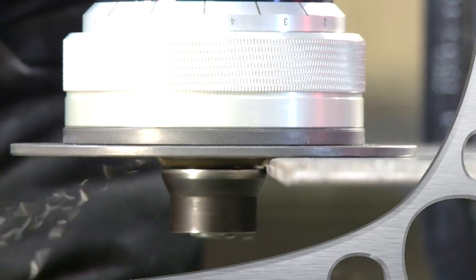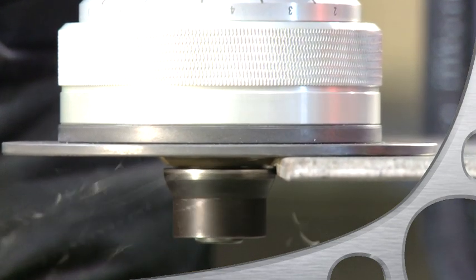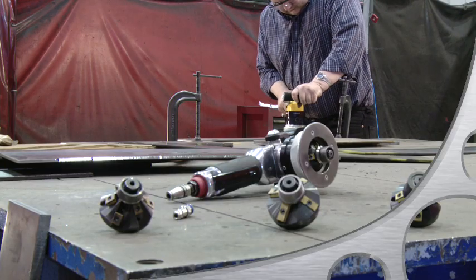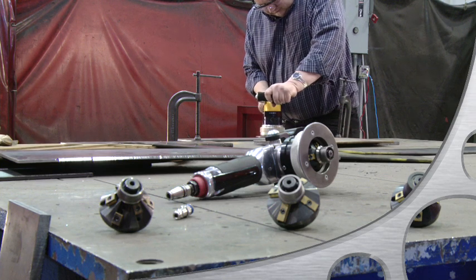As a novice, start off with a shallow cut to get a feel for the machine. The bevel depth is set by twisting the guide plate up or down and thereby exposing the inserts more or less. Once you get comfortable with the machine, feel free to be more daring and to run wider bevels in one pass.